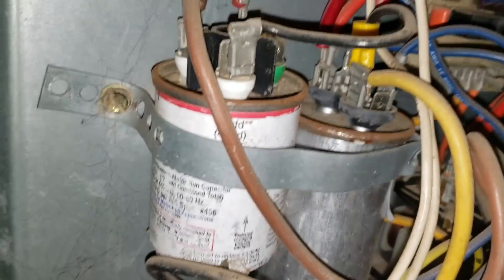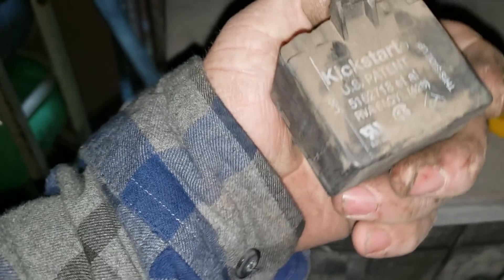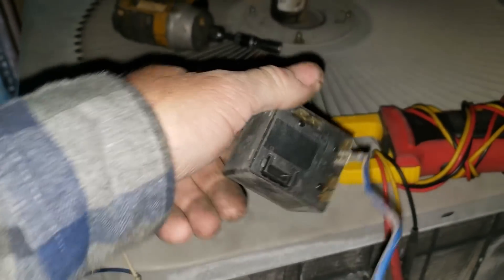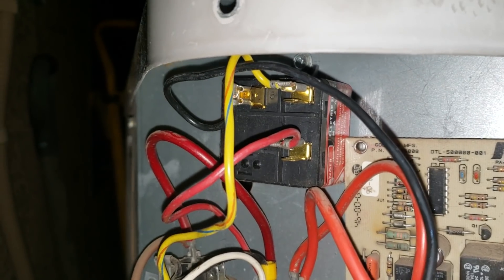Where's the potential relay? There it is. Okay, doing this in the dark here. Here's the old potential relay — a kickstart from the old KS-1. I'm sure the points are just seized in that. So I just pulled that out. I had an extra three-wire type potential relay just sitting there. I used the capacitor out of a 5-2-1 kit. So I just had that potential relay and rewired it.